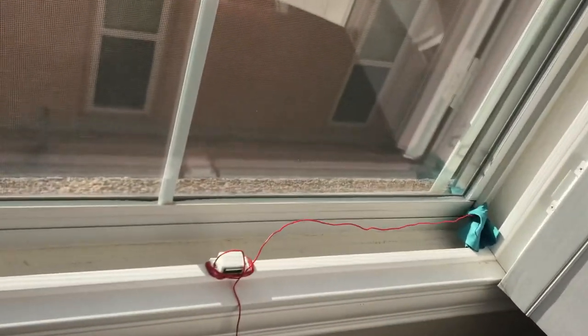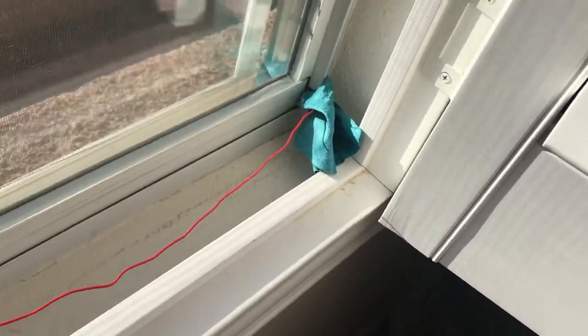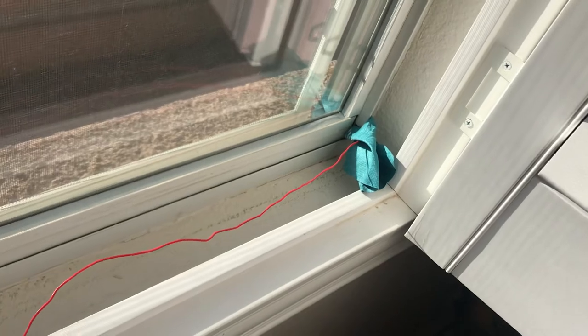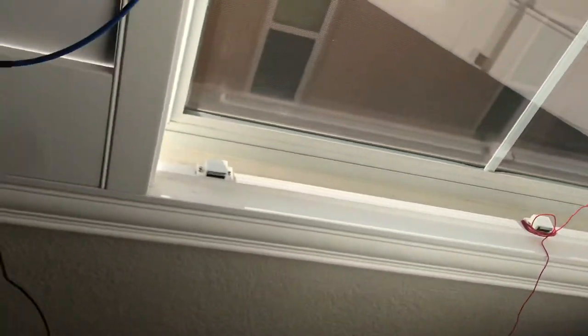I still have this crummy long wire antenna that is 240 feet long. It goes out the window and up to a palm tree. I did basically fix this antenna a bit — it doesn't really hit the house anymore. It deflects off an insulator on the wall. I just use a bit of lens cleaning cloth to make the wire not short against the window frame, and that seems to work somewhat. I just listen right now, I don't transmit.